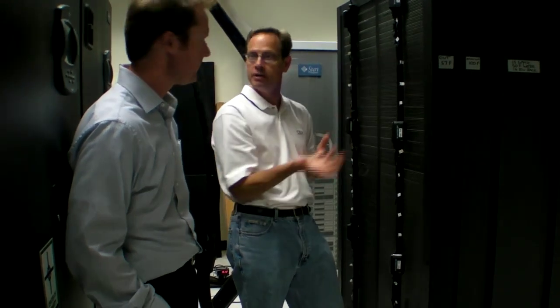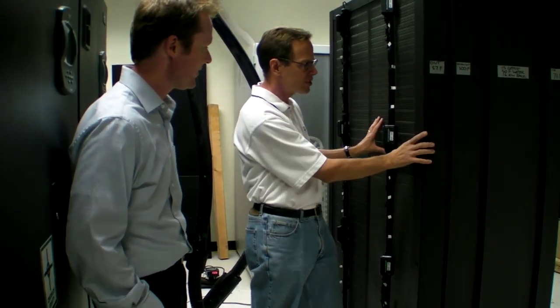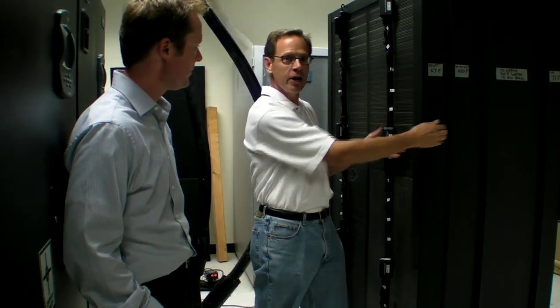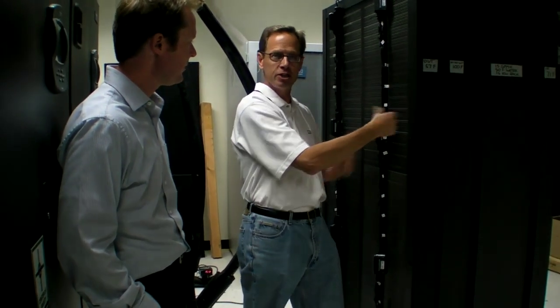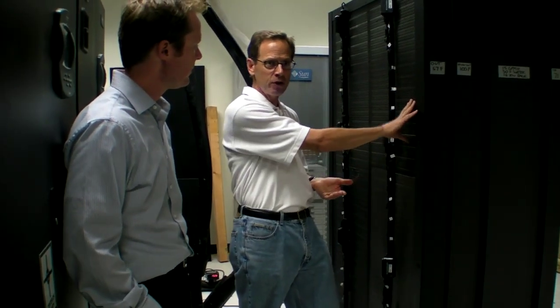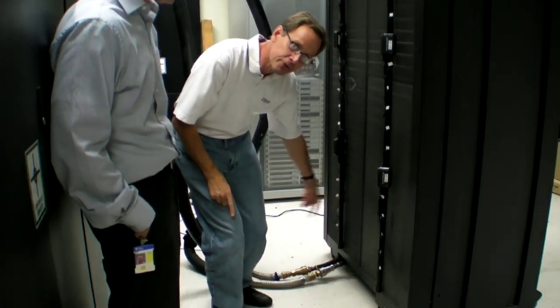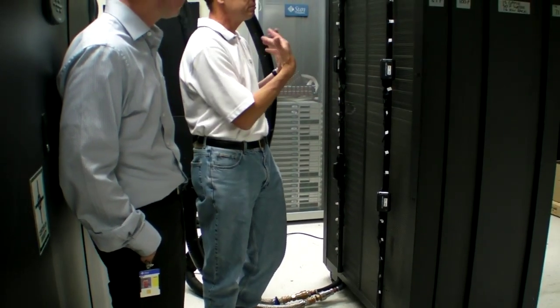These are part of the Chill-Off test setup — we're doing 36 temperature measurements. But the system itself is just the heat exchanger using the fans of the IT equipment to move the air, so there's no additional power for moving air and doing heat removal. There's only the water, which comes in through one hose and out through the other hose, ranging between a very low gallons per minute up to 15 gallons per minute to take out the heat, depending on conditions.